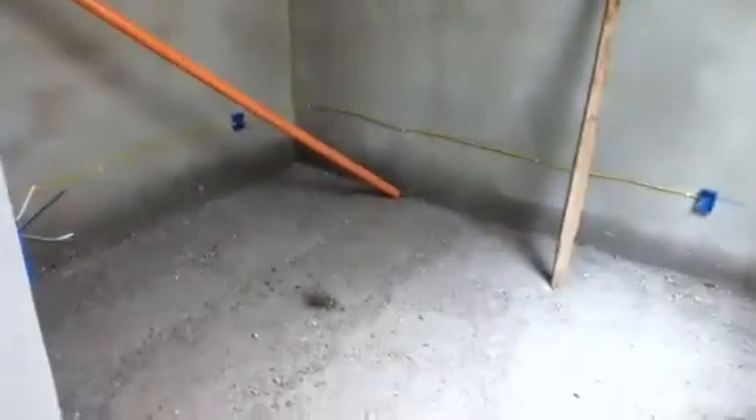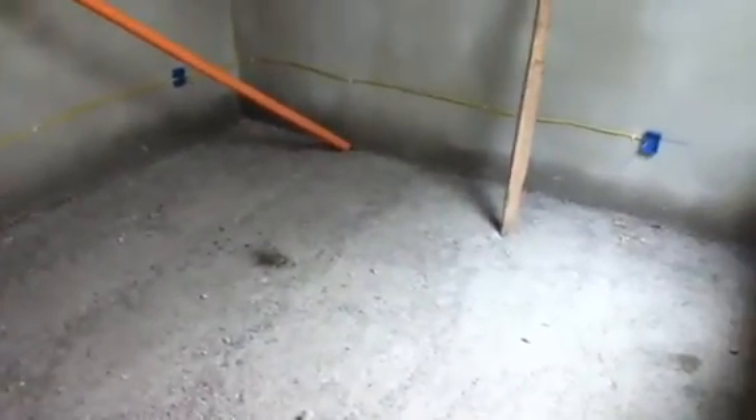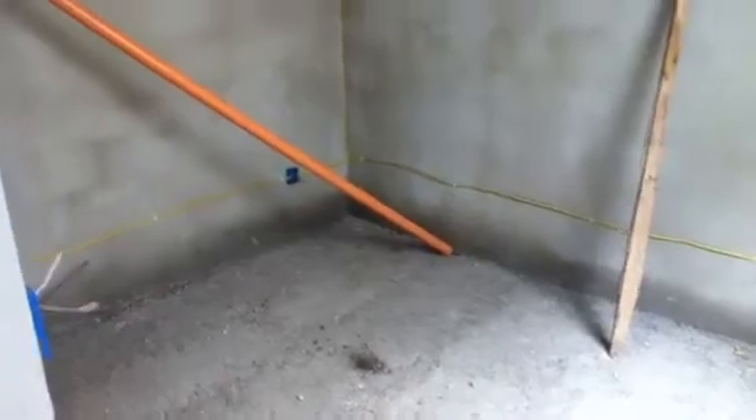This is the update for this week. Coming along — we've got some nice bi-fold doors. This was a mix-up on the design, but the guy who built the doors built a nice little bi-fold to go in there so we can open the door out. The original intention was this door would open in on this wall, but not a problem. Everything's drying real slow — there's so much water in this lime mix on the bottom. You can see it's all real wet around there from the floor soaking up into the block. It's going to be a good three or four weeks before we can paint anything.